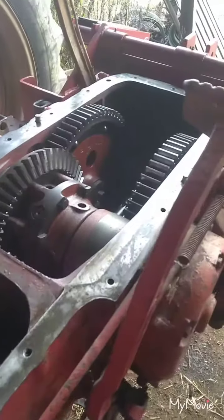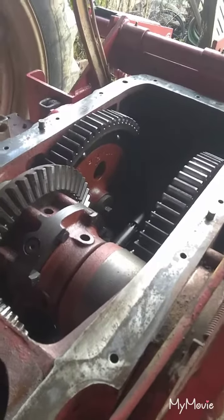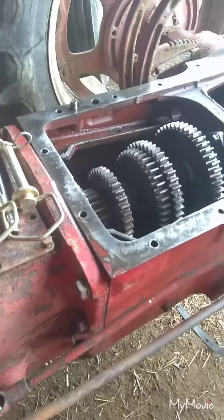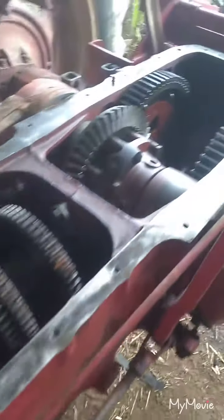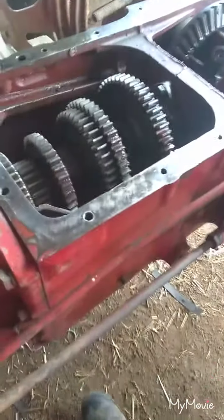We're off. Some of the bolts are in kind of bad shape, so I got some new ones we're gonna put in when we put it back together. I'm just gonna use RTV for a gasket, but I got this one all cleaned up, smoothed down pretty good. I put something on to keep it from rust until I get the transmission cover back on, but we'll just use a little bit of brake clean to wipe it down.